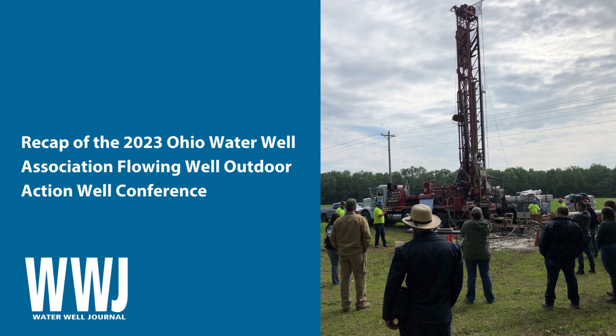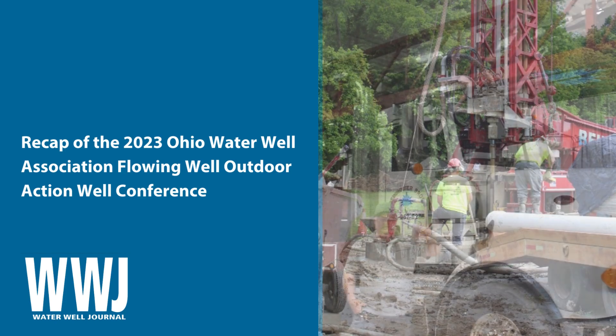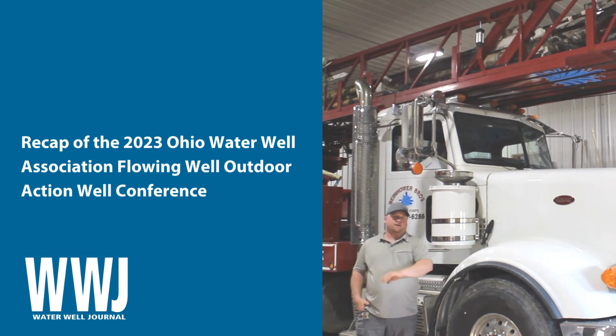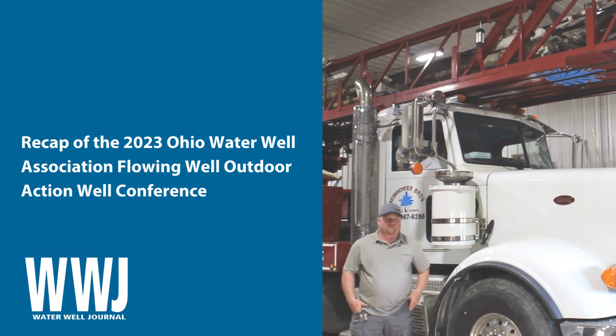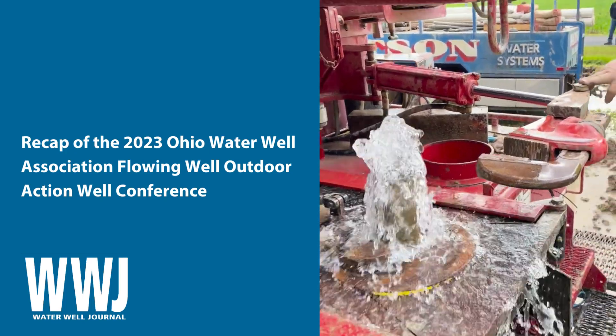What was unique about that site was on top of the hill — there was about a 90-foot elevation change from where we drilled to the top. They had a hauled water storage tank at their garage up top, where the bedrock is outcropping in certain spots that produces little to no water. So you go down the hill, it's connected to a vein that ties into Acton Lake, from what I've been told, and our well flowed 350 gallons a minute roughly.